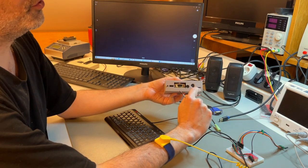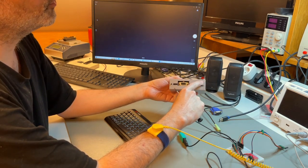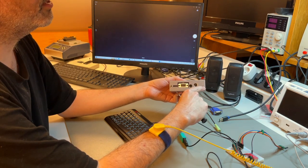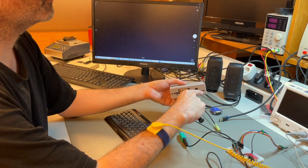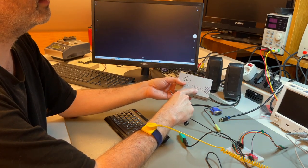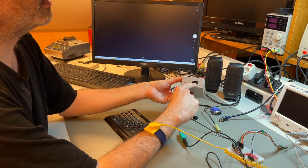You can put your sketches on the microSD card if you're using it as a microcontroller. It has an autoexec.txt file — if you put the name of a sketch there and that sketch is also on the card, it will work just like an Arduino: you turn it on and it starts doing what you set it to do.